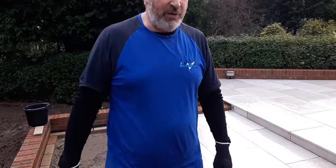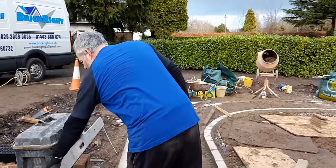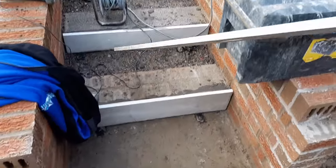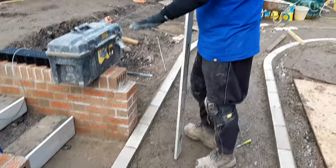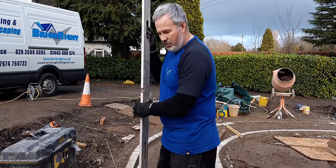If I just go past you Fraser, follow me up and I'll show you what's happening up here. When we come to this bit here, we've put the risers on — show them that Fraser — the three of them. So the risers are on, we've just got to put the treads in. It'll work out that we've got 100mm risers, the same as everything else all the way around. So that works.